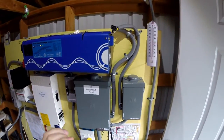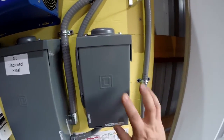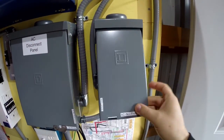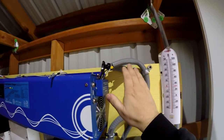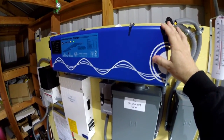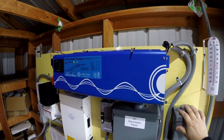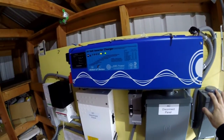Let's start here from the grid. What I have is an AC backhaul coming in from the grid going into this box here, and I've got 30 amps coming in. That's going up here to this inverter, and it's actually hooked into the inverter's charger. I use this AC backhaul as a supplemental power source to charge the batteries when it gets really dark for a long time, because it gets dark for a long period here in North Idaho. So this actually supplements the solar panels.